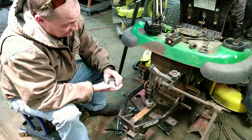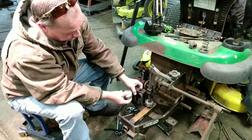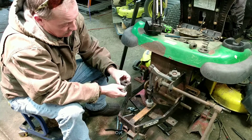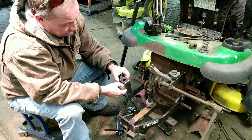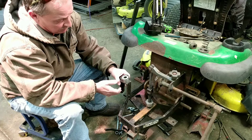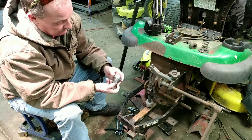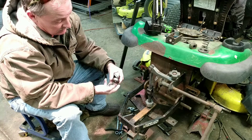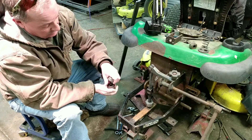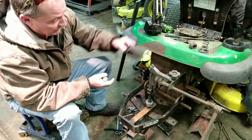The other thing is I built another one of these bearings, so we'll have two of them. The reason is that if you want to put downward force it needs a bearing down here, and if you want upward force we need a bearing up there. So it really needs two of them if you want up and downward force. There are a lot of little pieces in these to make them work properly, and I went ahead and built a cover for them.